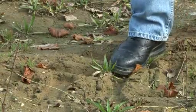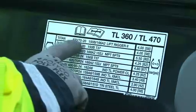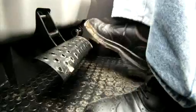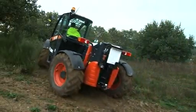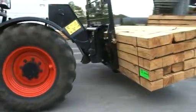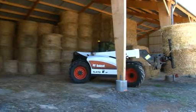Surface conditions, the type of tire and tire pressure can all affect overall machine stability, along with dynamic forces such as acceleration, braking, turning, and operating on inclines. Remember, when traveling on the worksite, always drive with the boom low and fully retracted, and always fasten your seatbelt. Allow for adequate clearance in front of and behind the machine when turning.